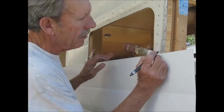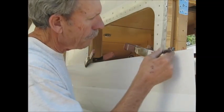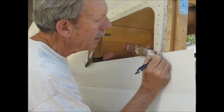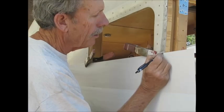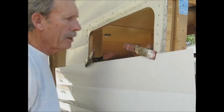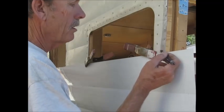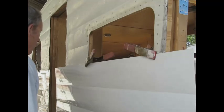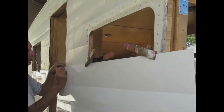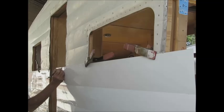Normally what you would do is make a line — a little mark almost to the top of the S-fold of the seam lock where it's going to slip in and get covered up. You make a little mark there with your ballpoint pen — I always use a ballpoint pen because it makes a nice thin line. Give it a sixteenth of an inch room at the top because when you staple down the sides it may want to expand a little bit. You need a little room for expansion. Make a line here, a line there, anywhere you can — at the window, here and there.